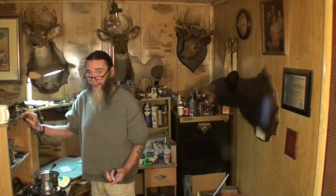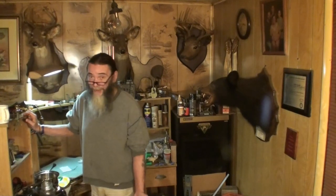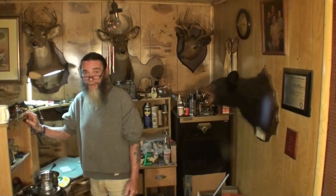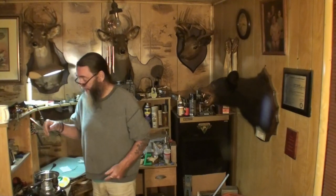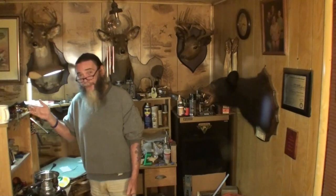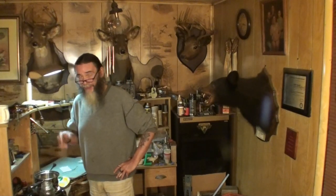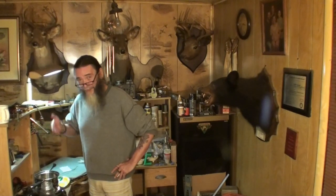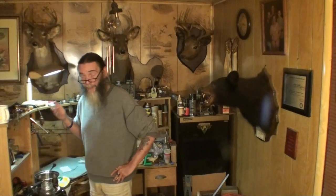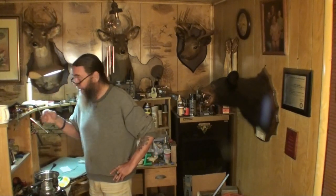If you don't know if your pickups have been wax potted or not, it don't hurt to do them. If they've already been done, it don't hurt to do them again — in fact it may help them even. All the music we heard in the old days was played through unwax-potted pickups, and I think Eddie Van Halen may have started or had something to do with it. Be careful, because if you get that wax too hot, it starts creating a mist in the air that is highly flammable and very dangerous around fire or spark. Thank you guys for watching. I hope it helps, and I'll see you next time.